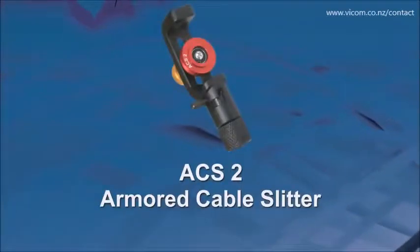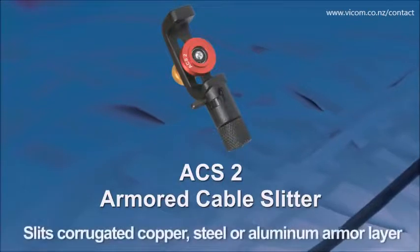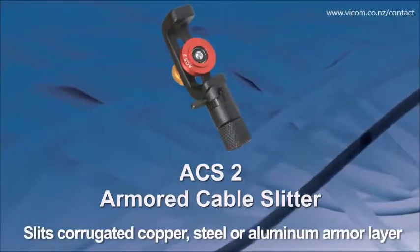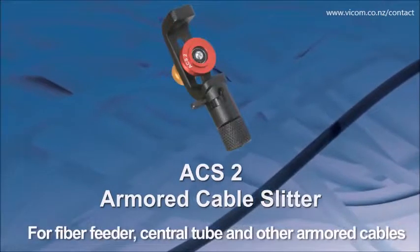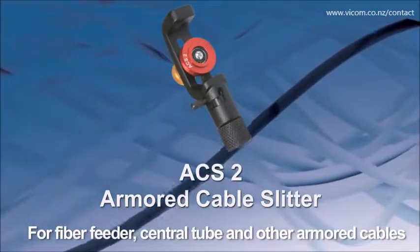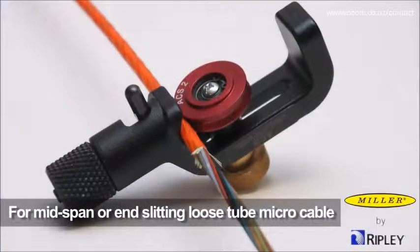The Miller ACS-2 tool is an armored cable slitter designed to slit the corrugated copper, steel, or aluminum armor layer on fiber feeder, central tube, and stranded loose tube fiber optic cables, as well as other armored cables. The ACS-2 cable slitter can also be used for mid-span or end slitting of the thin jackets on loose tube micro cable, typically used in a blown fiber application.